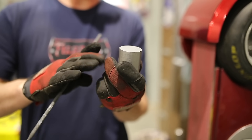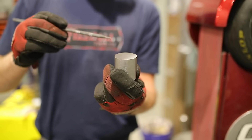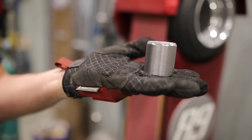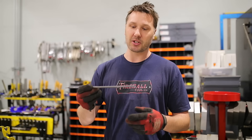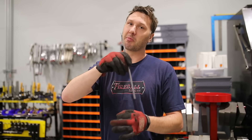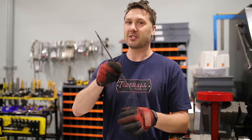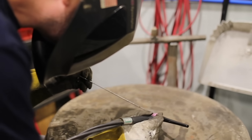This bar is way too soft to have any sort of cutting edge on it, so I want to weld a cutting edge on the outside circumference of this bar, sharpen it on the grinder, and then try to push it through. Here's the slug — I want to put a chamfer all the way around 360 degrees around this edge, looking for a bevel that aligns with the body. That way we can fill it in with metal and come back and grind it or put it in the lathe and turn it back to diameter. I'm going to use this UTP 711B — a hard-facing rod used in excavating equipment, which the specs say gets to about 60 Rockwell. I'll knock all the flux off and use it as TIG filler to precision-place the amount and thickness of the weld bead. I want a lot of material around the edge, so I'm going to use the lay-wire technique to build up a big fatty weld on this edge.